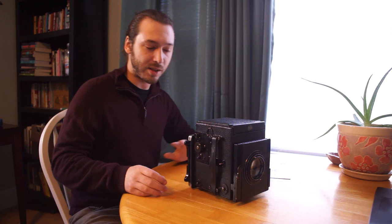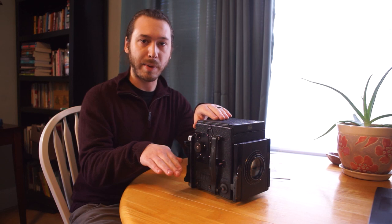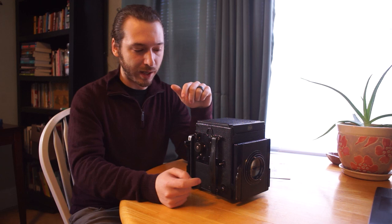What he's describing in the patent is that instead of the mirror arcing up from a fixed single pivot point like it does in a Graflex SLR, there are a couple of pivot points in the mirror system. So the mirror swings back as it's moving upward, and instead of the arc going forwards, he manages to push the arc backwards. This shortens the necessary area of the body and lets the lens get just a little bit closer to the focal plane. We'll show a little bit of the mechanics of that in a bit.